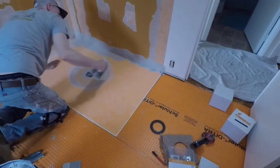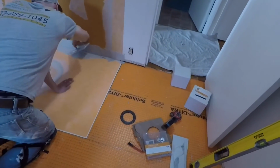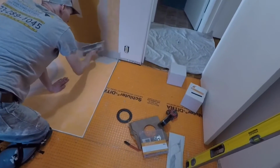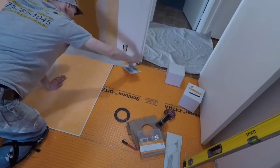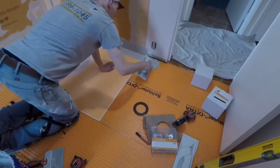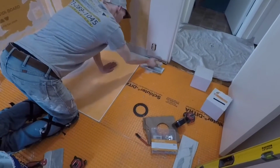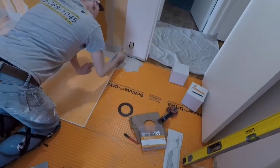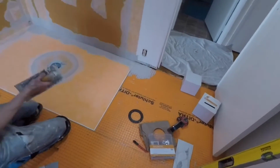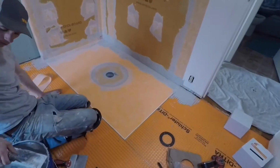When we put the base trim back, we'll just cut the top of the Kerdi band off. I mean, even if it just probably flops and doesn't get actually anchored beyond there, you know what I mean? It'll still have a good crease, don't you think? I think that's probably going to be just fine. Yeah. It's not going to lose its waterproof ability.